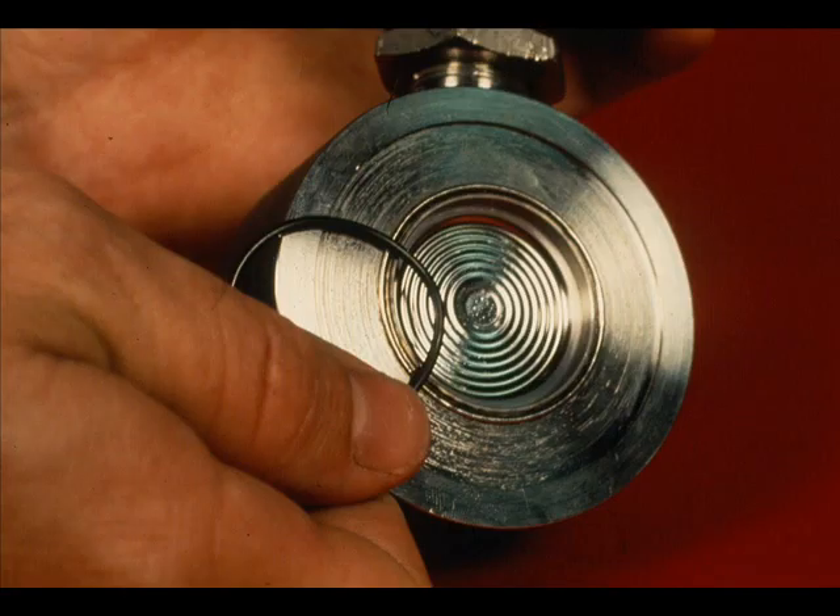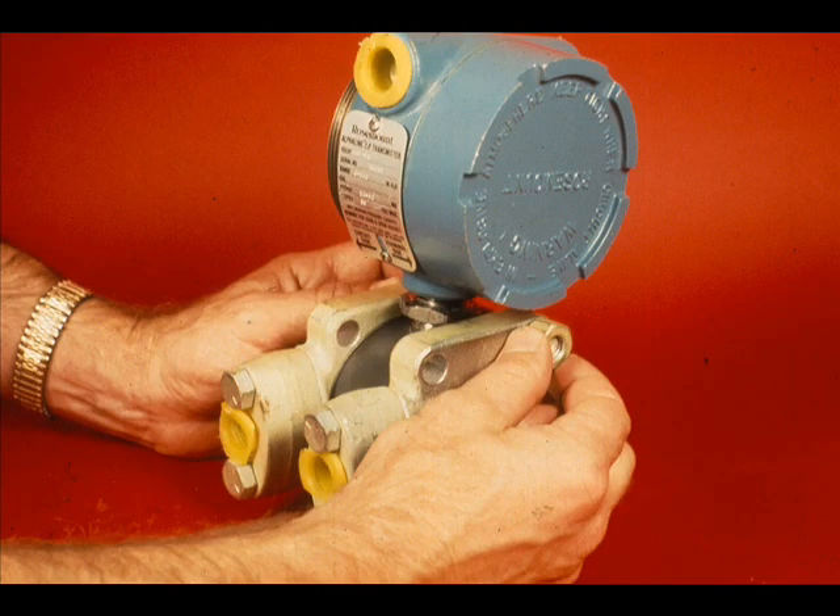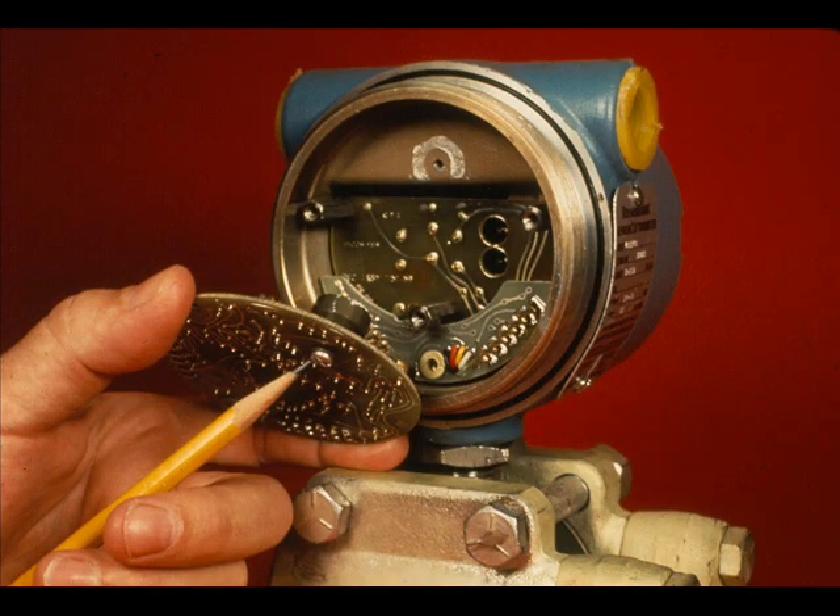To reassemble the sensor body, inspect and carefully position the O-rings around the isolating diaphragms. Properly orient the flanges and first tighten the bolts finger-tight. Then diagonally and evenly tighten the bolts to approximately 30 foot-pounds. When reinstalling the amplifier board, the heat sink screw should be started and made snug before the three holding screws are installed.